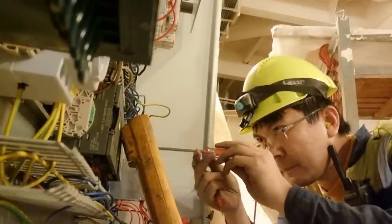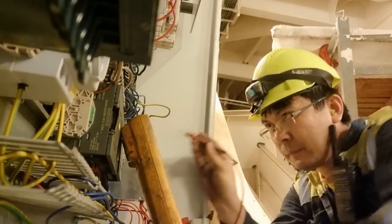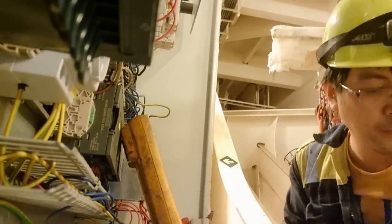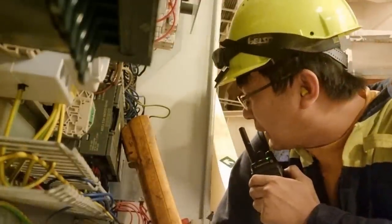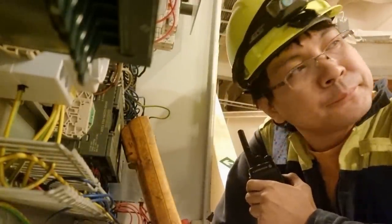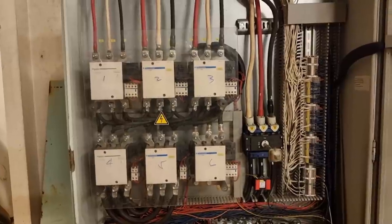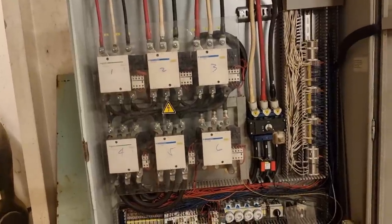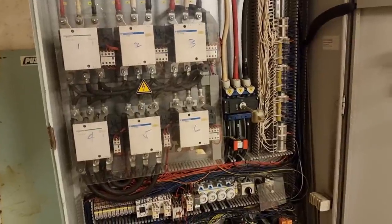Based on my experience, I am always having the same situation with these winches. If we do not have second speed and third speed on all the controls, it means the control voltage is not enough. After installing the replacement, I called the chief officer to test it, and based on the sound of the winch, we now have second speed and third speed confirmed by the chief officer.